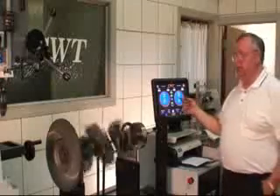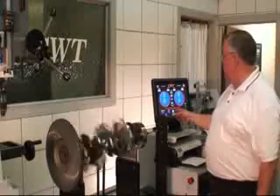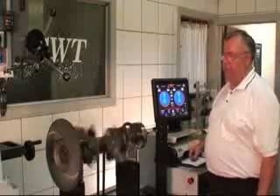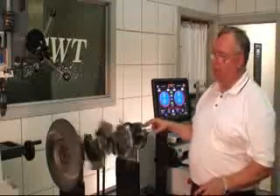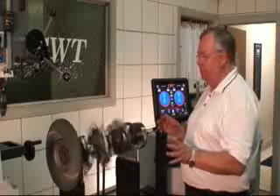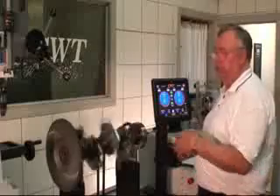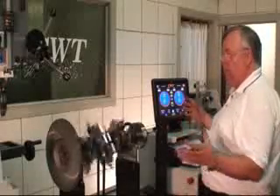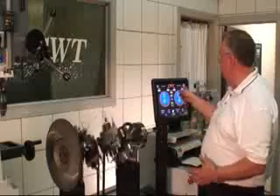What it's going to do is go for the target RPM at 500. Once it arrives there, it's going to go ahead and start analyzing. If there's any conflict — such as inadequate lubrication — you may see an alarm come up saying speed is not consistent. You need to stop and put the proper lubricant on. As it goes through the analysis, it looks at the left side, the right side, then it acquires all the data, and it shuts down once it has the data and reports.